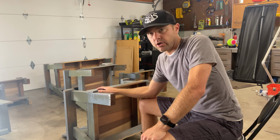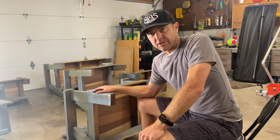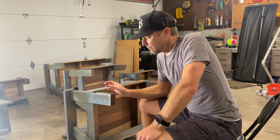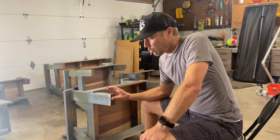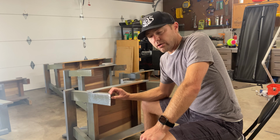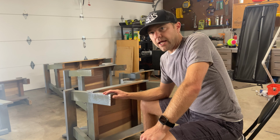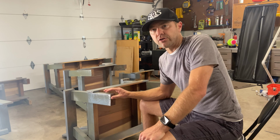And when you're spraying varnish on chairs, or spraying really any wood finish on chairs, what happens? Well, the chairs are sitting upright, and you're going to spray the finish, and so you're going to cover all the sides, all the angles, except for underneath the feet. This part will not get any of the varnish. And as a result, the bottom part of the legs are not protected with the wood finish. They are exposed to the elements as if you didn't refinish them because you didn't add any finish to them.